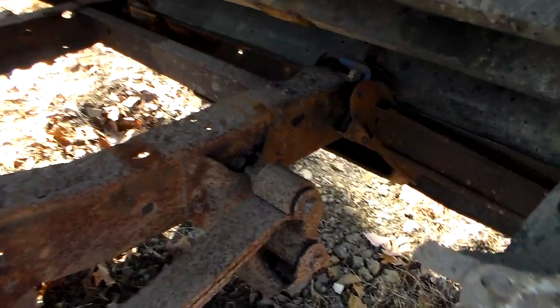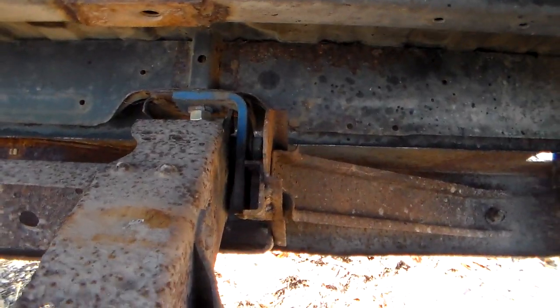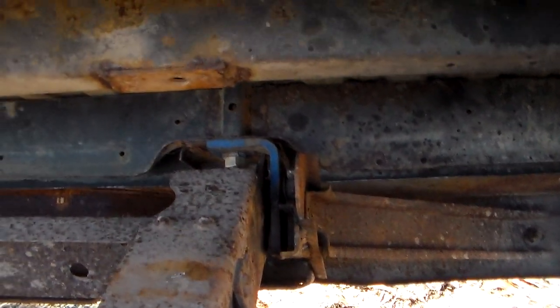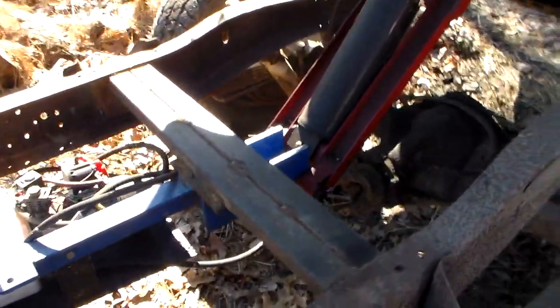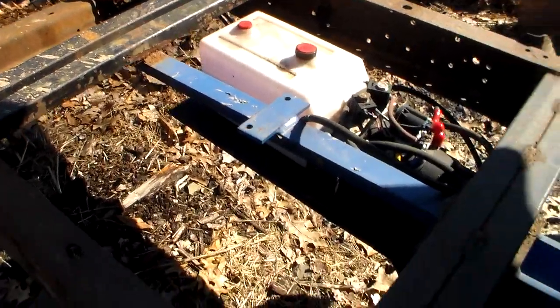On the original kit, people were asking how to do this section. You can see where I have the bumper brackets welded to the blue hinge sections of the kit — I had to use some spacers but got that all welded up nicely. I added in some brackets to make this kit fit this truck, including a cross member here and one there. Everything is welded solid.